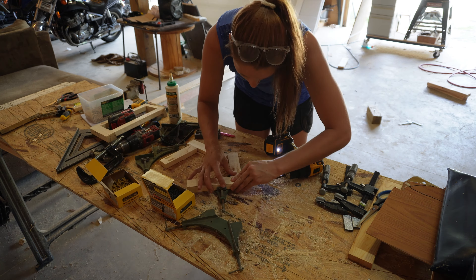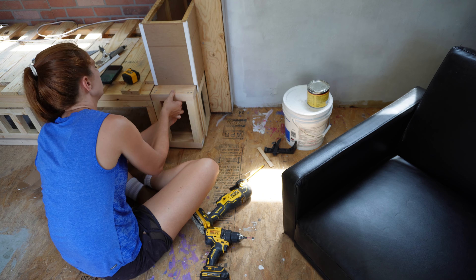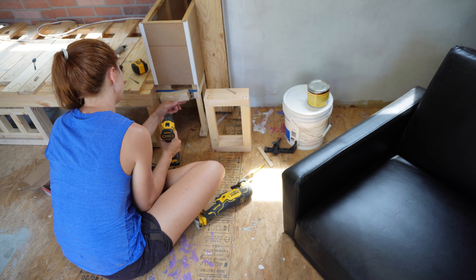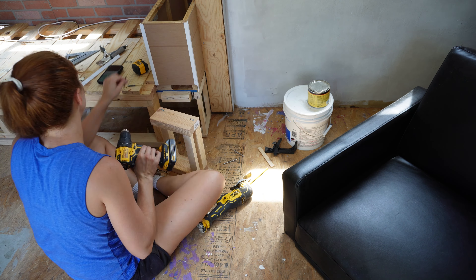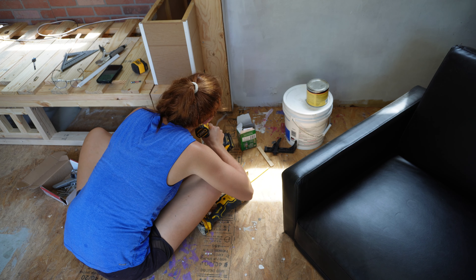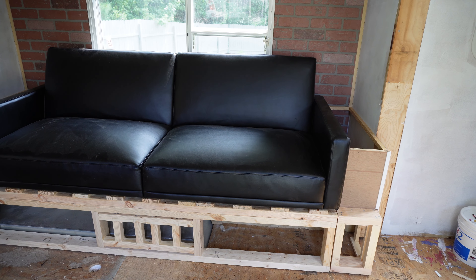Now that I have those pieces made, I'm attaching them to the side of the slide using two screws drilled directly into the aluminum frame, and it should sit flush with the box I already have. I didn't show how I made the front piece because it was the same process. This little piece I'm screwing into the frame is because there's not a good place to screw the front piece in — it's going to act like a shelf that the front piece sits on, so I can screw it in from the top and fasten it to the slide. I also added a small piece on one side so it can touch the other side piece, letting me screw them together and make sure that corner is perfectly square. I'm using inch and a half screws, screwing it in from the top. Did the same thing on the other side, and I'll end up upholstering this after I paint. Hope you guys are enjoying this — see you for day ten!